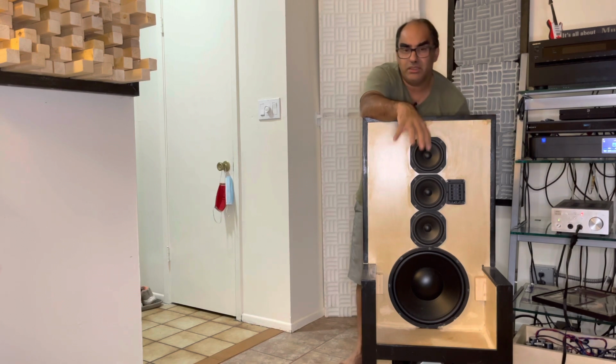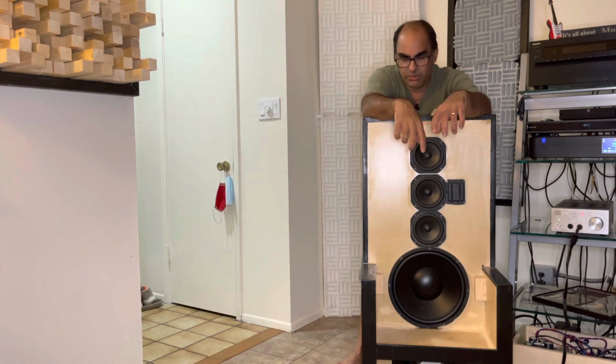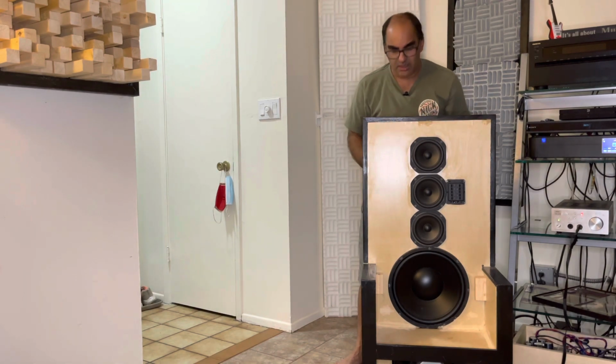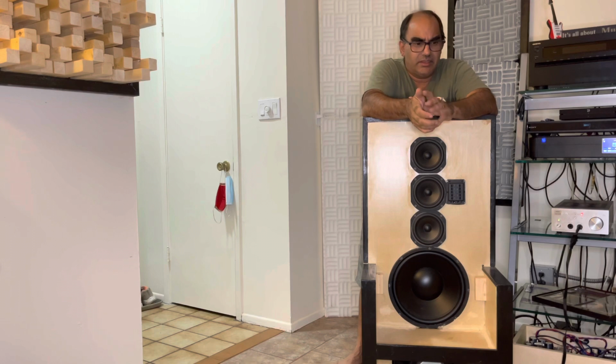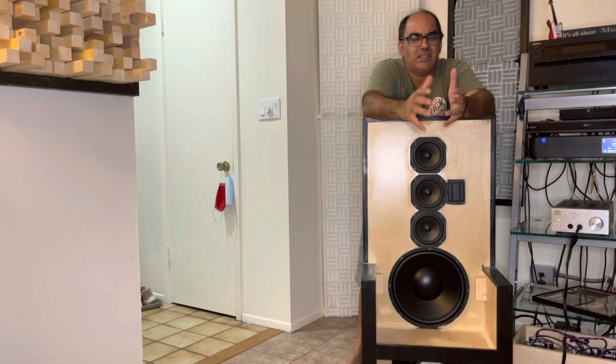Power supply noise was completely eradicated just by changing out those 3 capacitors, the speaker capacitor and the 2 power supply caps. So, be that as it may, Sunday morning there's that aluminum can capacitor, and I never understood this, and maybe you guys can enlighten me, why would you want 3 capacitors in 1 can? Where's the space savings? I know this probably goes back to radios in the 1940s or 30s or whatever.